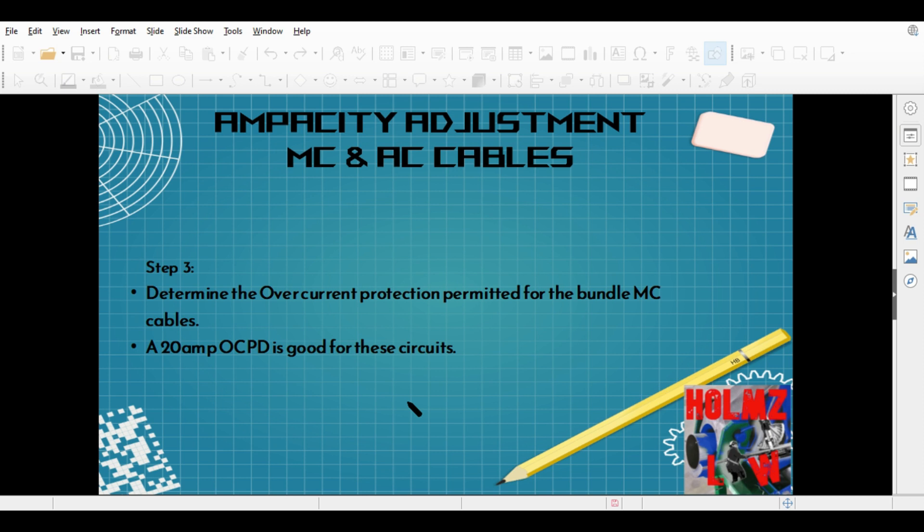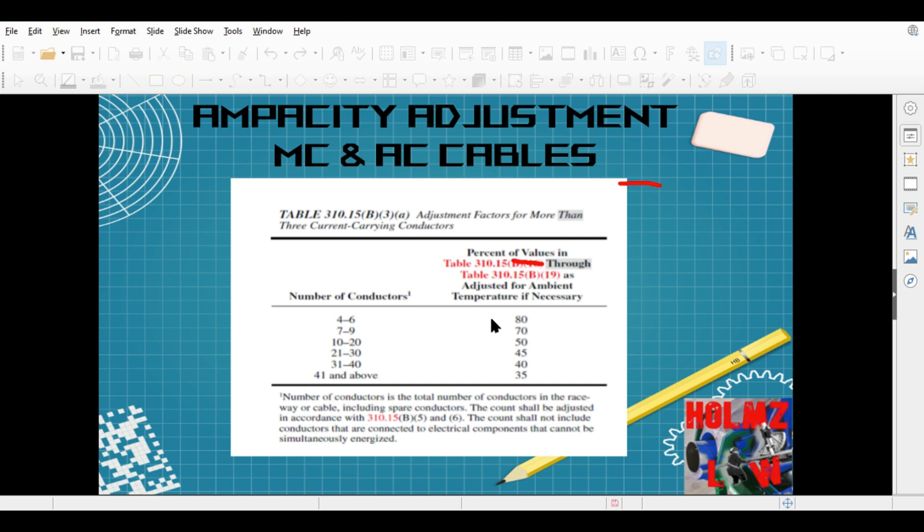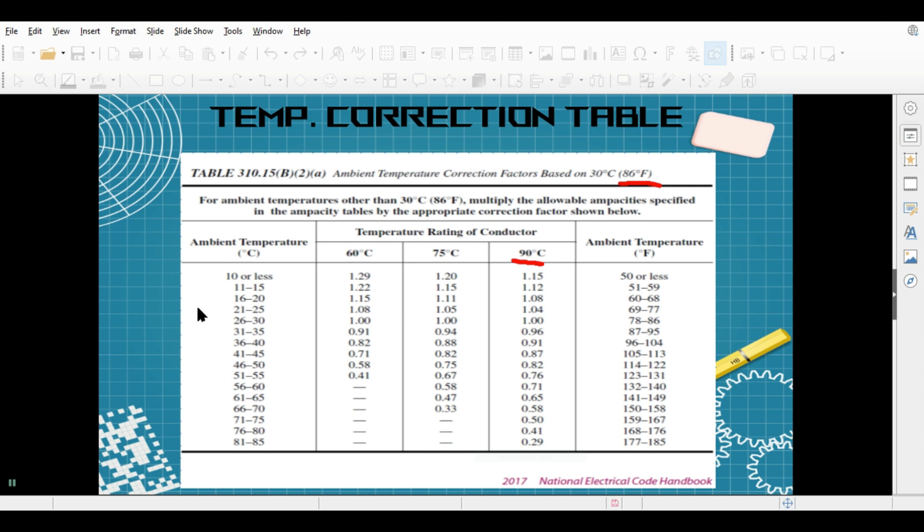You can read those yourselves to get a better understanding. If none of those special rules apply to your circumstances, you go back to the regular ampacity table and do a regular adjustment factor derating calculation — like if you have 10 AWG, or you have a PVC jacket, or it's not 12 gauge and you have more than three current-carrying conductors. In that case, the 60% does not apply.